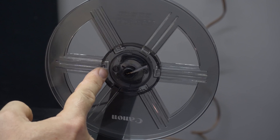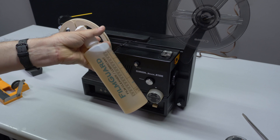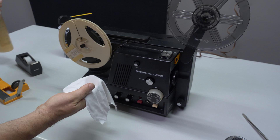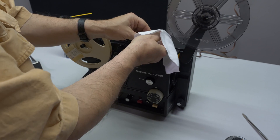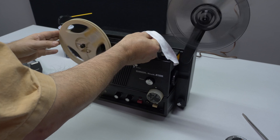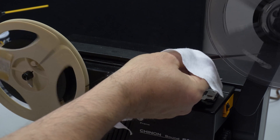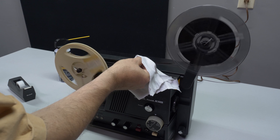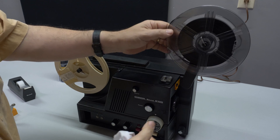Now something else I consider essential, especially for old film. This is a product called Film Guard — I'm not affiliated or sponsored by them in any way. Film Guard is a film cleaner and lubricant. It's not real cheap but a little goes a long way. Spray a bit on a soft all-cotton cloth and gently wipe your film from beginning to end, using a new part of the cloth every minute or so. It's amazing how much dirt is on some films. The residue it leaves seems to hide a lot of small scratches on the non-emulsion side — it's kind of a poor man's liquid gate transfer. It also seems to greatly help in preventing dirt buildup in the projector gate. The manufacturer claims it's safe for all types of film including those with magnetic soundtracks.